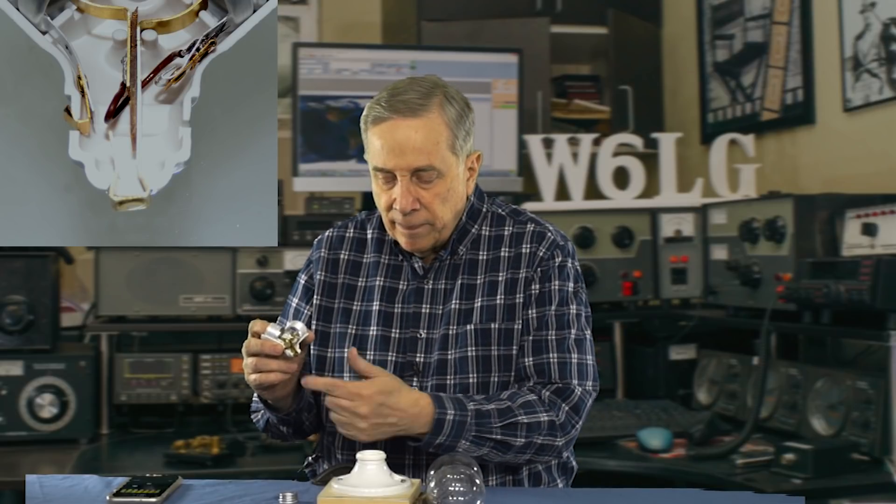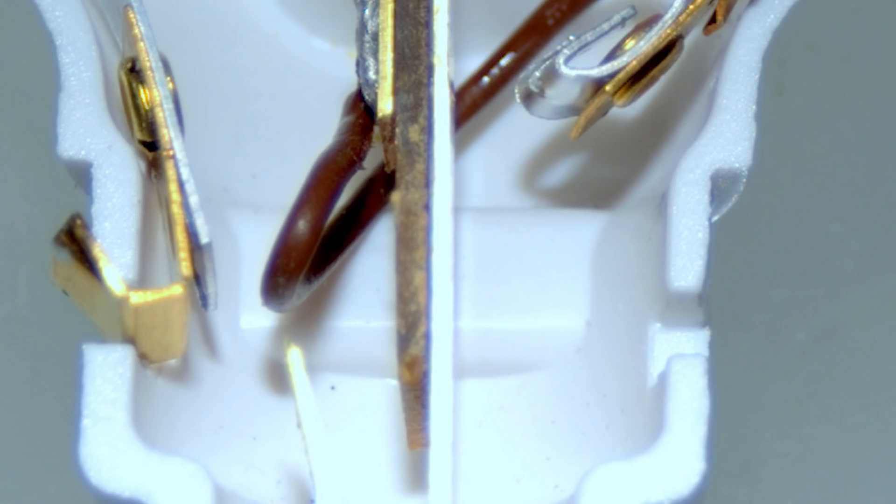With the socket attached, I'm feeding the outer ring with the shield of the coax. The center is being fed with the center conductor. What I did to make this into a dipole was to split this brass-looking piece — I think it's plated, it may be brass. I took some side cutters or sheet metal tin snips and cut out a section, then connected a wire so that I'm feeding just the center on this socket and not both at the same time.